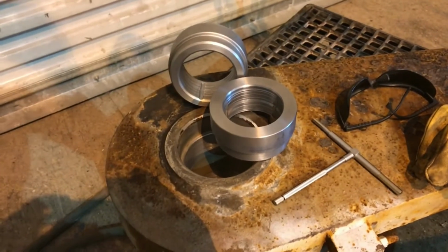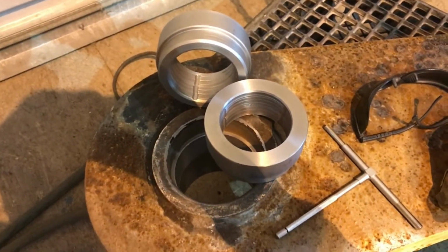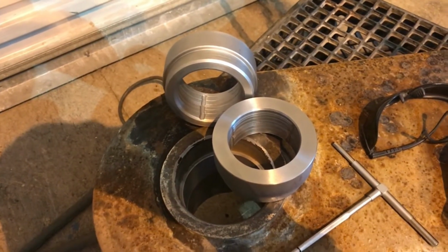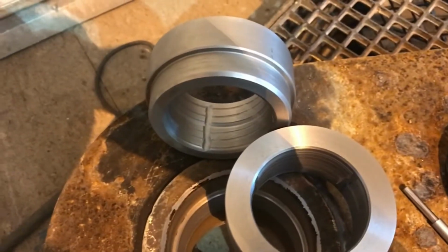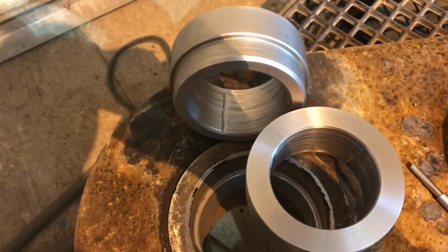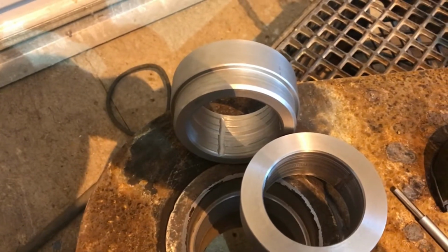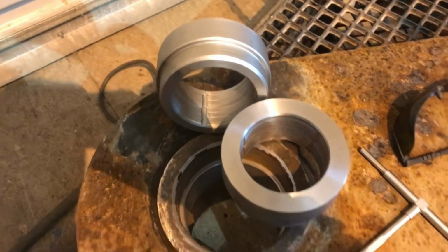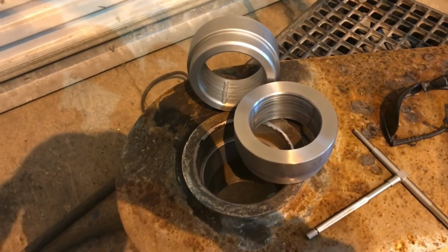Well, there are the 2 bushings done. Just getting ready to stick them in the freezer. Get them cold. I'll heat up the part. Should slide right in. Maybe a little force, but should be good. I cut grease grooves in them. Big one all the way around the center, 3 cross that almost go out to the outside edge. And then I also do a spiral so that it really spreads the grease out. Something like this really needs good greasing, so I'll put a new grease zerk in it and clean out the hole before I slam them together.